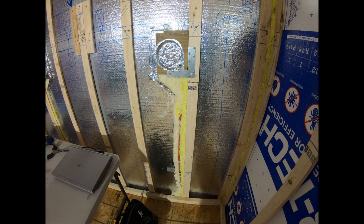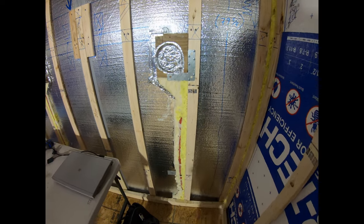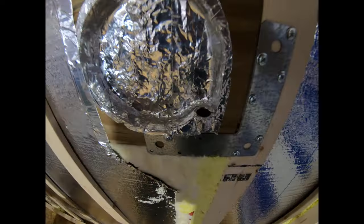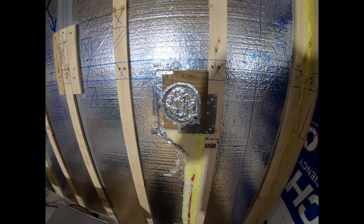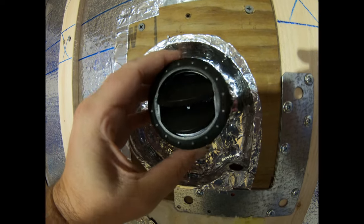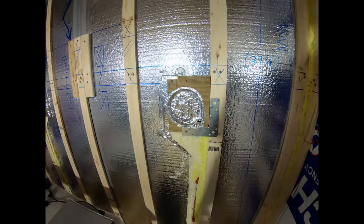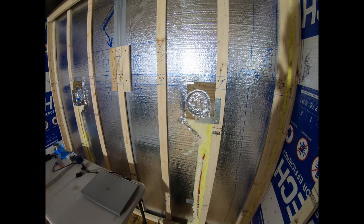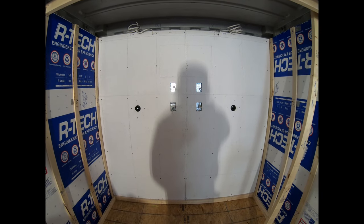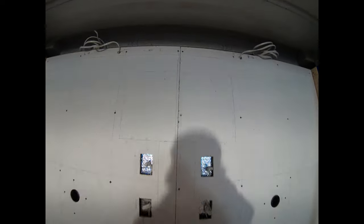For those interested in a fresh air intake — it's similar to something like an aircraft or a tight RV. We have a fresh air ventilation system, filtered, that runs through a PEX pipe. It's super small but all you need is a puff of fresh air. We're going to mount these vents here — it's like an RV vent, similar to an aircraft. Just a little puff of fresh air, and this will also help us keep a positive pressure in this conditioned space. The panels are screwed on the wall with silicone and liquid nails — it ain't going nowhere.